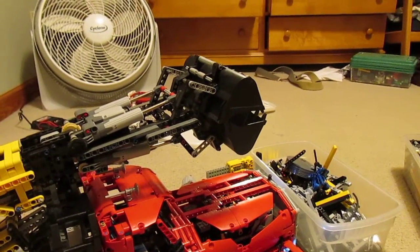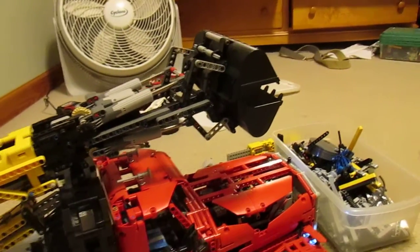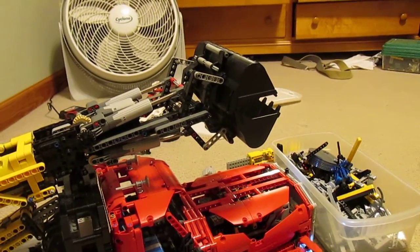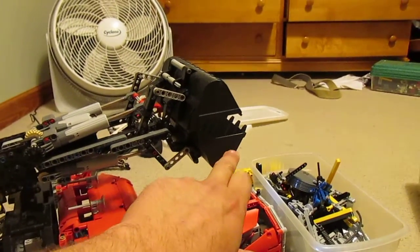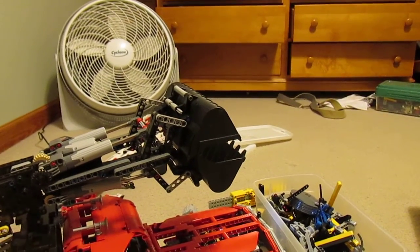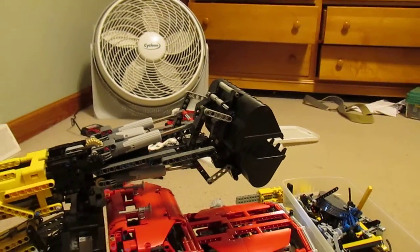For the movement of the bucket we have the opening and the closing. I think, just because of the range of motion that I'd like to achieve with this system, I'm going to rearrange the linkages a little bit — maybe make it so that this lower bucket comes back farther than it currently does and consequently doesn't go as far forward, and the upper bucket goes farther forward than it does but doesn't come back quite as far.